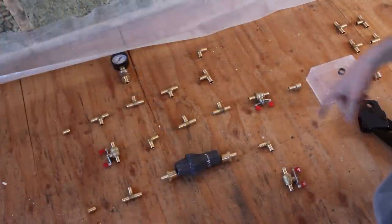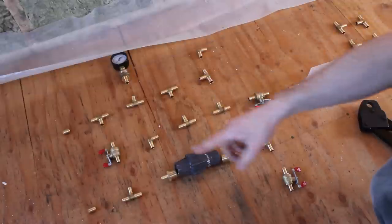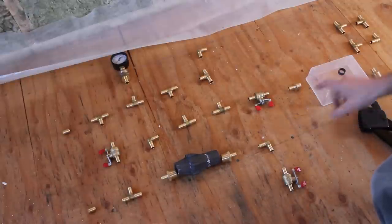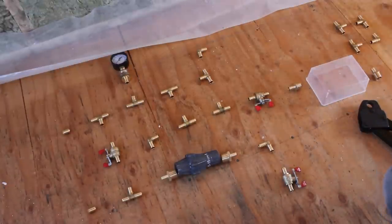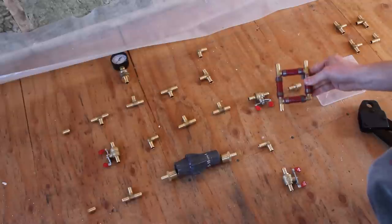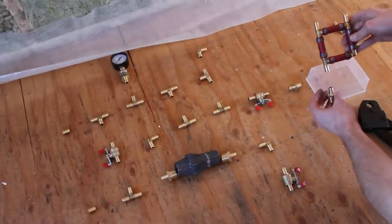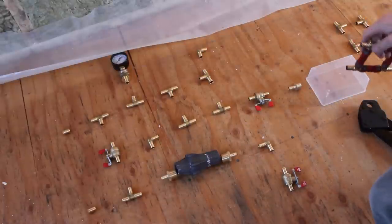I've taken some time to lay out the whole contraption for where the water is going to enter the house, and I'll explain how this all works once the pipe's in place because it'll be easier to follow. I'm pretty sure I've got it in the most compact configuration possible. I just put this here to represent the water heater, and on this side I had some extra pieces so I practiced assembling what's going to be the hot water manifold. I'm pretty confident with how it's going together, so I'll add this piece on to finish it off and show you how I'm going about crimping, and then I will assemble the whole thing and show you how it's going to work.